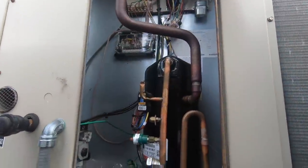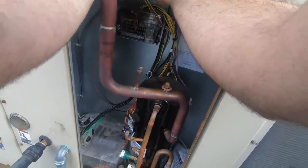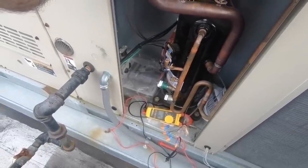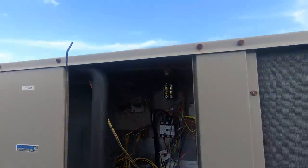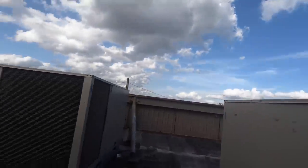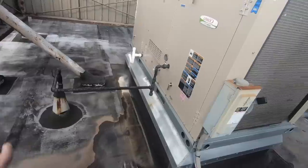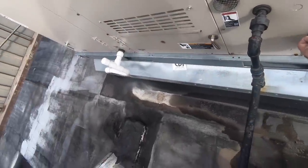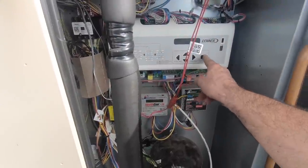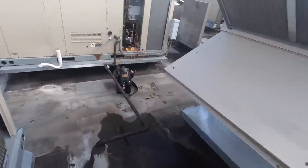I'll jump it and bring it on — G, Y1, R — we're on. Unfortunately this unit's not labeled. I could have a bad thermostat. I have an out on the Prodigy. That unit's not the problem — this one is the problem.